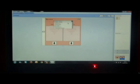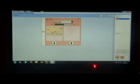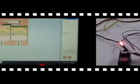Here we will select the distance sensor, that is the IR sensor, and the port which is connected, so port 1. Now we will drag and drop the expressions here in the sequence builder. In the sequence builder, this is the intermediate mark. When the range crosses this, the RGB LED goes green and the servo motor takes a 180 degree shift, and below this range the RGB LED goes red and the servo motor will take a 0 degree shift. So I'll make it a loop and play the sequence. This way the IR sensor detects and we build a sequence.